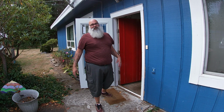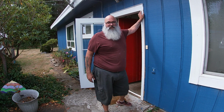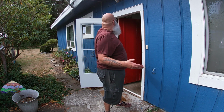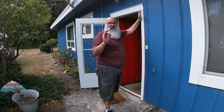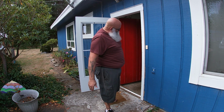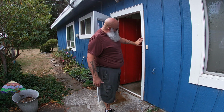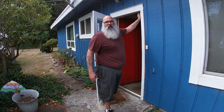Now that embarrassment is over with, what I did is I ended up pulling off the frames here, and I cut about 3/4 inch off of each side, making sure that my opening was 35 7/8 all the way from the top down to the bottom. As you can see, I've got a lot of caulking to do and some holes to fill and touch up, stuff like that. But the storms are coming.